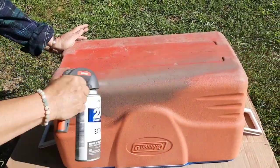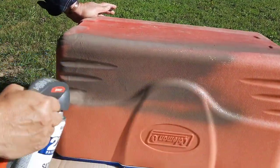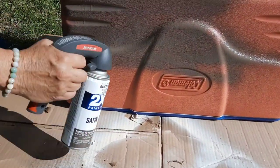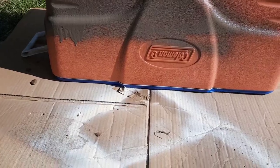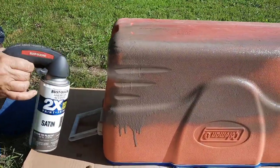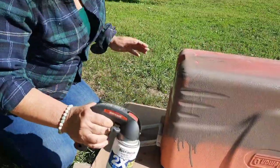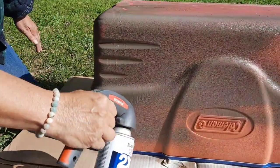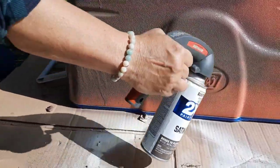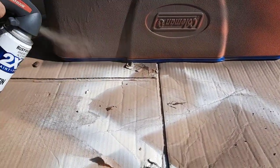So we're just good — this is London Gray. Don't go too heavy. Lightly, because what you want to do is light coats and more than one coat. See, it's dripping — if you go too heavy, it'll drip. Don't do as I do, do as I say. Very light coats. Don't be in a hurry. Patience. Light coats. And we can already see it coming together. It does tend to even out. The next coat I will do will be with it upright. It all seems to work out when you spray paint — it is forgiving.